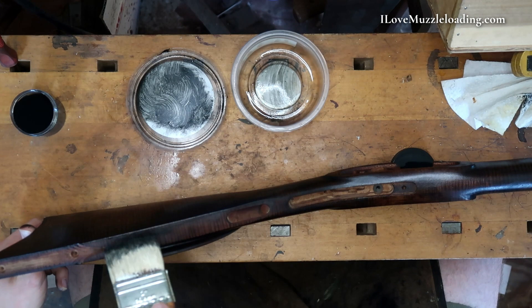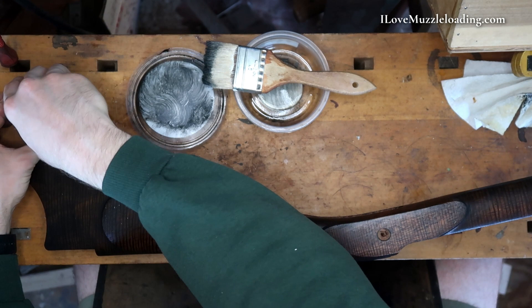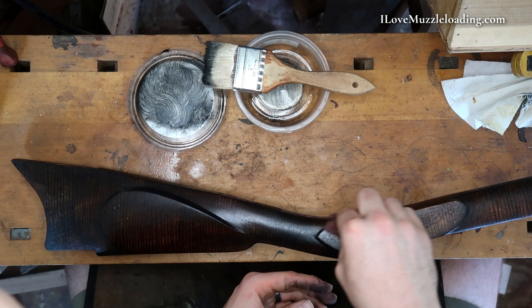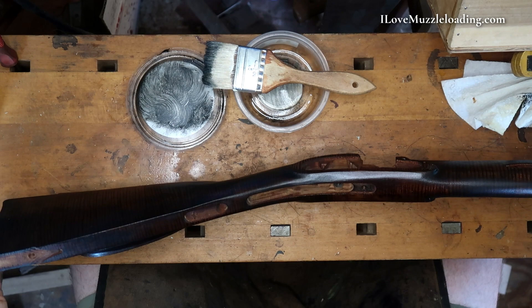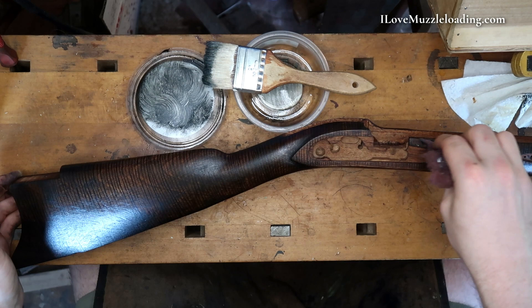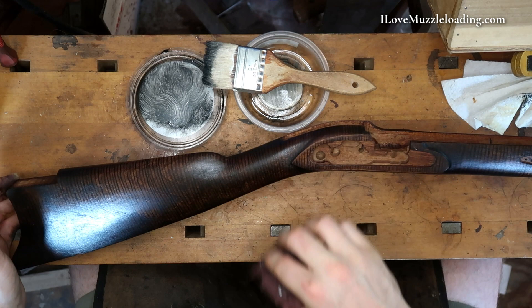As this is drying, we can take a little piece of Scotch-Brite and come in here and hit some of these high areas to re-establish some highlights in the carving. While we have the simulated wear and age of the bone black, we can also bring back those highlights on the edges where edges would be worn and used a little bit more than the flats. Being really gentle, just trying to hit just those edges — we want that nice crisp highlight line as we go around.